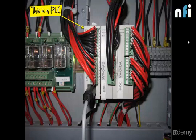So very quickly, let's understand the basic components of PLC. Now, in front of the screen, you can see this is a PLC by the company Delta Electronics, and we have some input terminals. Now these are the terminals onto which the inputs will be connected. Now what are the inputs? Inputs can be switches, sensors, limit switches, or any source of inputs.